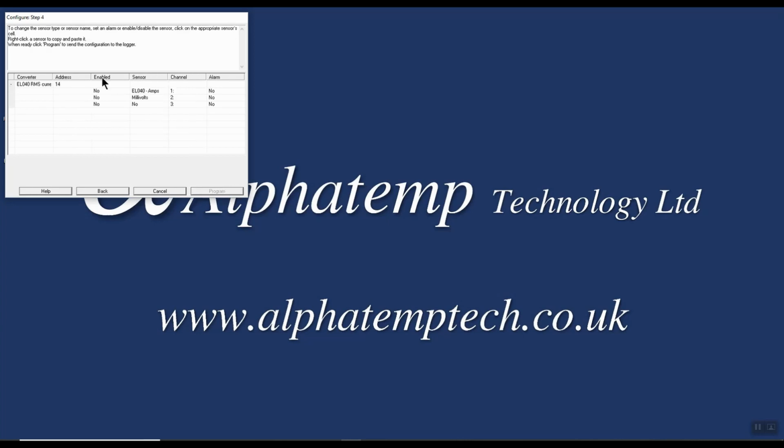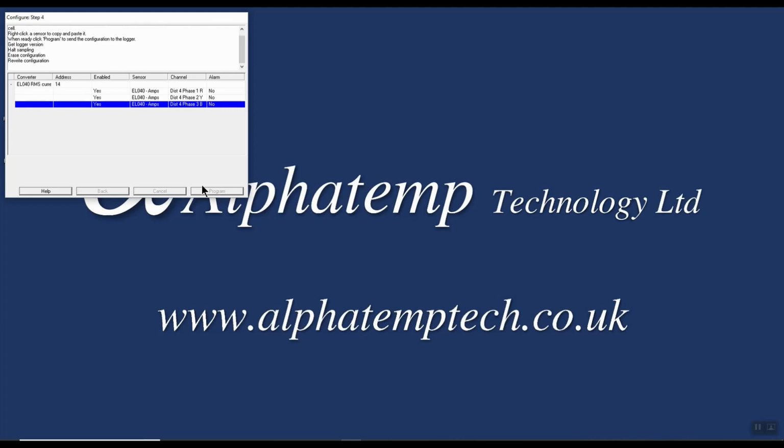on address 14. We now need to enable each of the channels by double-clicking on the columns, and we need to ensure that each sensor is set to EL040 amps, for each channel. The next thing we need to do is to give them channel names. This is distribution point 4, so channel 1 will be dist 4, phase 1, R for red. Channel 2 will be dist 4, phase 2, Y for yellow. And channel 3 will be dist 4, phase 3, B for blue. We can now click on Program. This will write the configuration information that's on the PC into the data logger, ready for us to start recording.